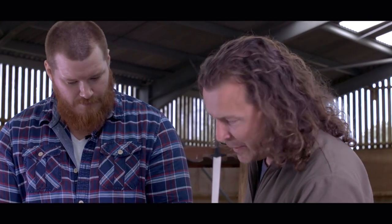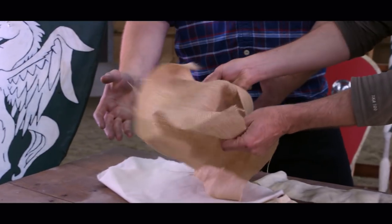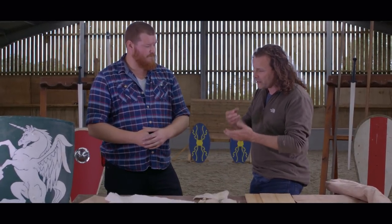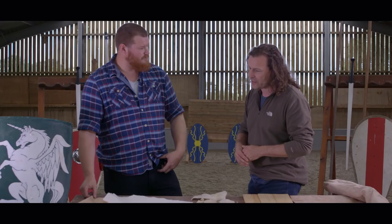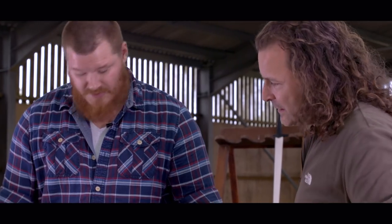We've got the wood as the base, and this is a kind of Hessian material — loose weave. Once this is placed on top of the shield, it's filled with glue; the gaps in the loose weave fill and it actually acts like a natural fiberglass. It's like modern fiberglass — strands of glass in a resin — but this is effectively an ancient fiberglass with Hessian or hemp, linen or flax, combining with the cheese glue on the surface. The strands add strength so you can pull, twist, and push in various directions and it won't fracture.